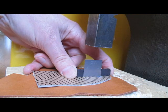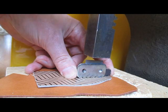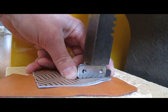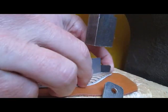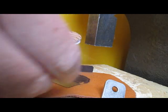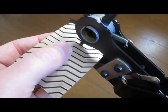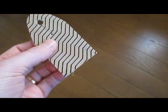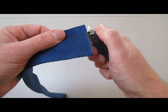To create the slit I'm using effectively a razor blade which has one edge completely blunt, jigging it up under the arbor press again using a magnet to keep it parallel with the work, to keep the blade vertical, and just gently pressing in to give a perfect cut every time on the line. I'm just punching a hole at the end to prevent it from fraying any further. Just to say again — that slit is actually too long.